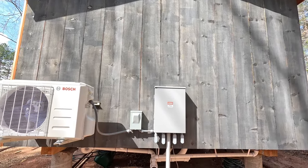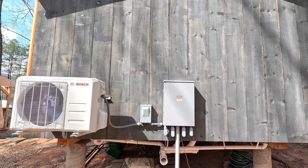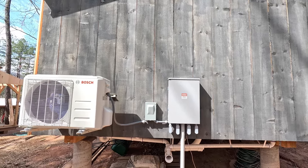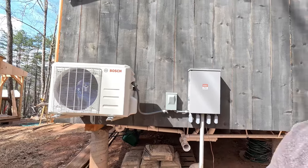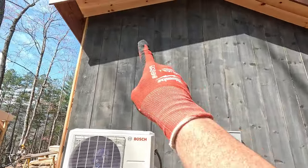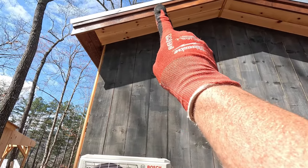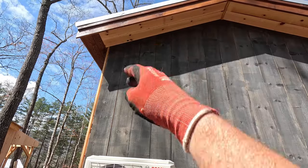So I'm going to go back upstairs, take a look at where 30 inches would be on that inside wall, and make sure that's not going to fall over there where the vent line is going to come out. That vent line will come out underneath the eave there, straight out and then up above the roof line.